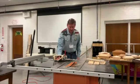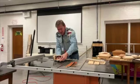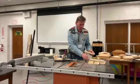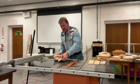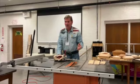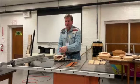Those boxes are cut about at this angle. That square upright box is cut somewhere around here. All you do is you find out, you're holding it about where you want it, anywhere below this line. Cut yourself a spacer block. There's your angle. Doesn't matter what the angle is. You're going to cut them all the same off this same spacer. So you're never finding the angle.